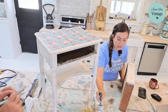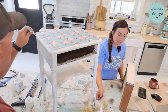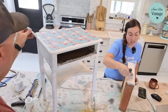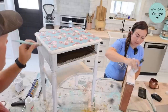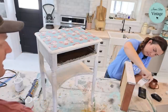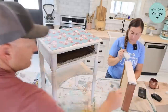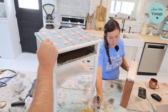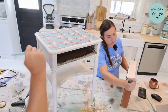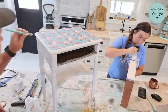I don't paint the sides of the drawer because A, it's going to be inside and they're not finished to begin with, and B, if you paint the sides of the drawer and the next person paints the sides of the drawer anyways, they stick. It's just a personal preference. What we will do is sand where the brush strokes are so that it's just wood. You could tape off your drawer if you wanted nice crisp lines, but we usually distress it anyway, so it's a non-issue.